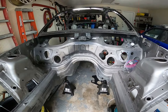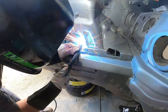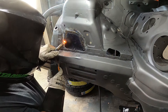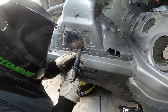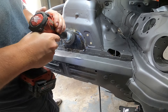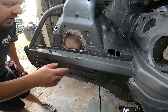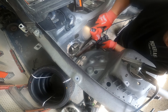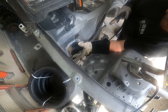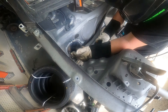As you can see, for most of the welding to the chassis I'm doing this start-and-stop method, which I know isn't ideal. But with the welder I'm using — it's a Hobart 140, which is a good unit — it's either too hot or not hot enough. I probably should have used a little bit thinner metal for the patches I'm putting in, but nonetheless doing it this way I got really good penetration all the way around and for just being some firewall plates it'll work out just fine.